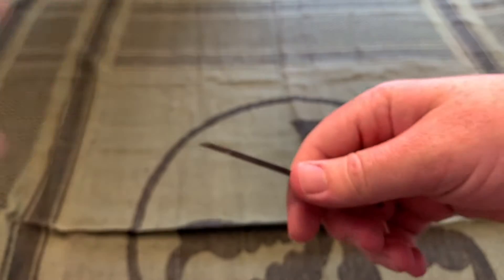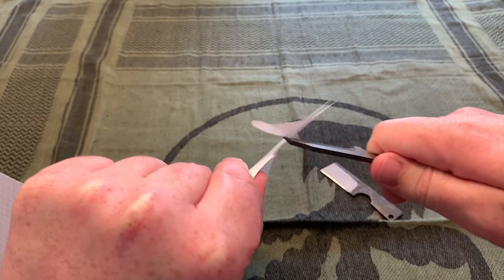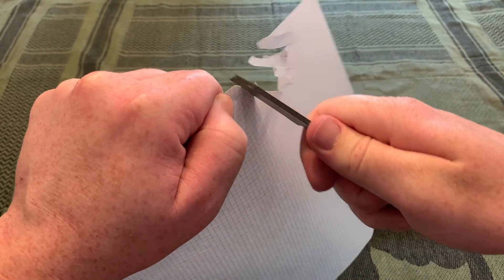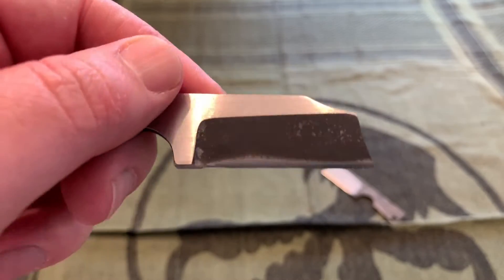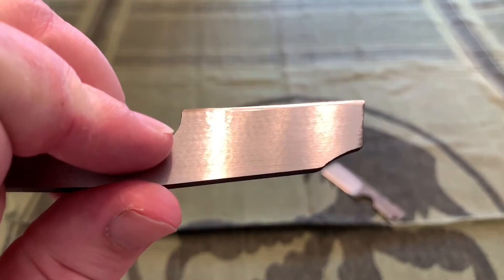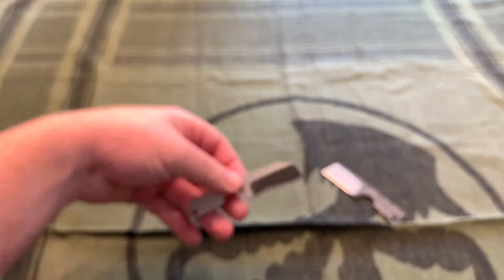These are far from perfect. This is not something I would ship out — I'm obviously not selling this, this is just a little test piece. I don't really love the design or anything of it. Here we can see if it's sharp enough to cut paper. I've cut paper with it. It's about as sharp as a sharpened butter knife, but it makes some cuts. I've cut a good amount of paper with it and haven't noticed the edge dulling yet, but I'd really need to put some use to it to tell, because even a not-very-hard heat treated knife could hold up cutting paper for a while. The heat treat seems to be good — hitting it on the whetstone it was definitely hard to grind down.